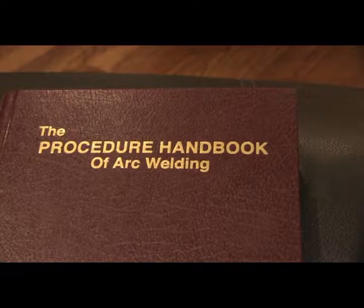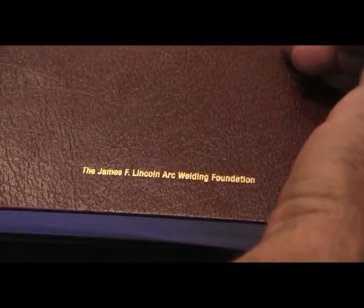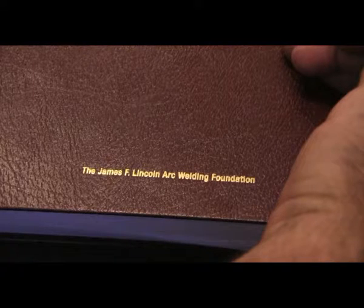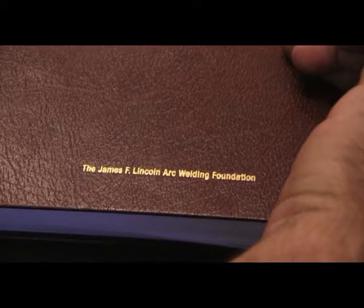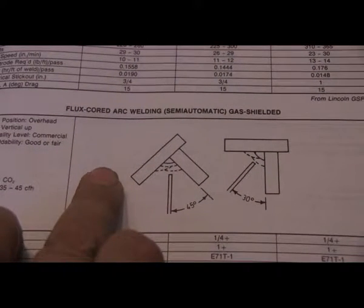A much better resource that I found was this. It's called the Procedure Handbook of Welding from the James F. Lincoln Foundation. And it's got a section in there for gas shielded flux core, and it's much more accurate settings. I'll show you that in just a minute. The reason it's more accurate is because it's got separate charts for separate positions.